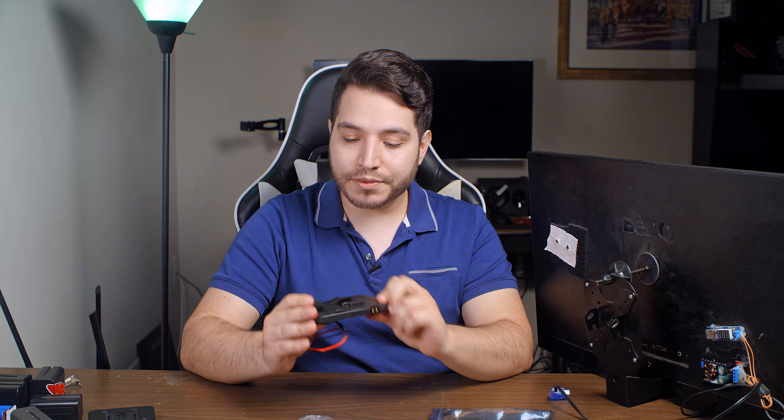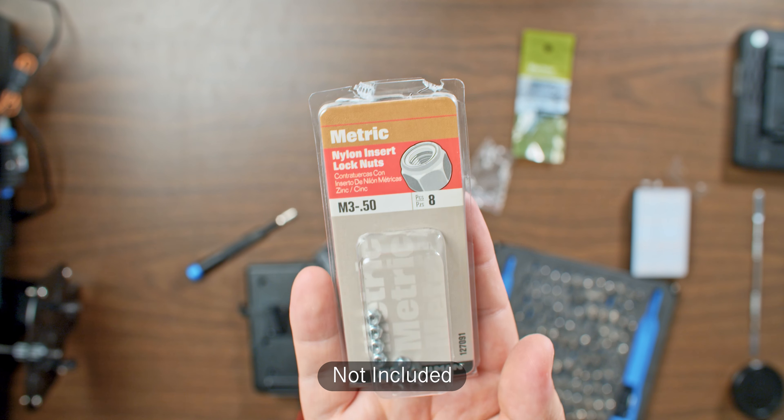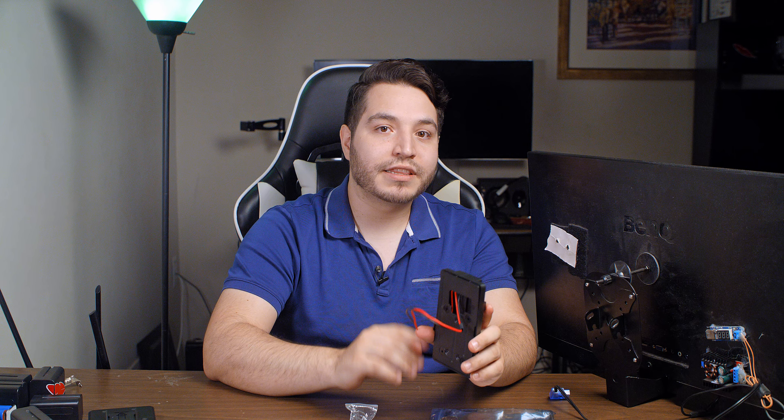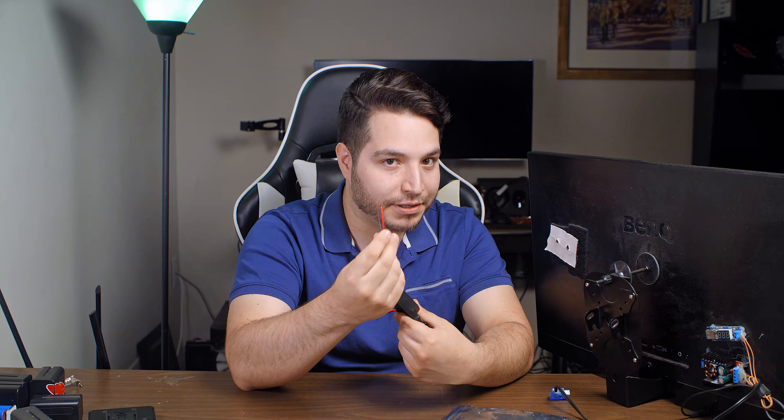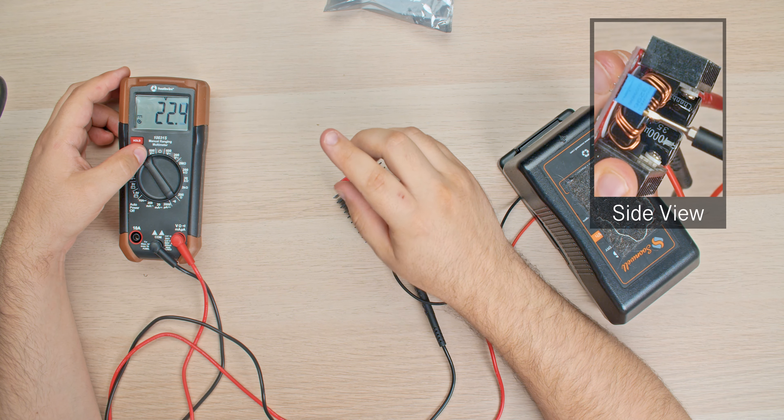Here comes one of the new additions — I need to find a way to mount a battery to the back of this monitor, and for that we have this V-mount plate adapter. You'd normally use this on the back of cameras like the Ursa. It came with four small bolts but no nuts, so we'll have to either source some ourselves or use strong glue. Now is also a good time to adjust your DC converter to the right output: plug the wires into the converter input with correct polarity, then use a multimeter on the output side and adjust the VCC potentiometer until you reach your required output voltage.